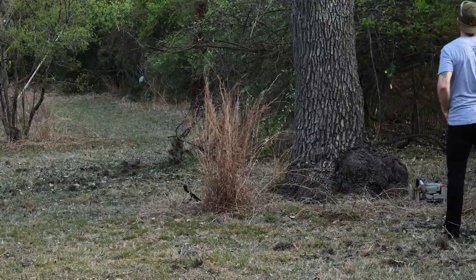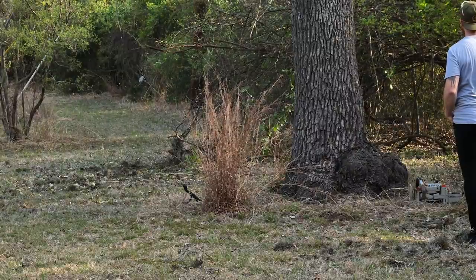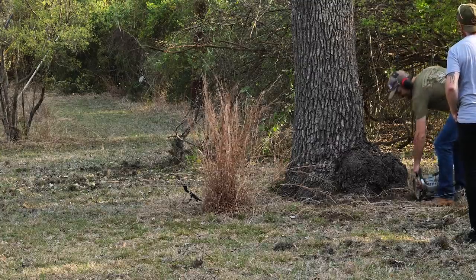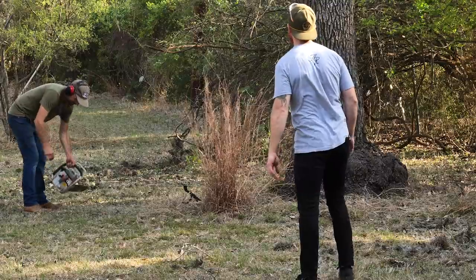So you cut flat here, and then down at 70 degrees, 1/3 into the tree. Come with your back cut. Do we need to get the laser out, yeah, in the angle finder? Not everything's furniture making, right?